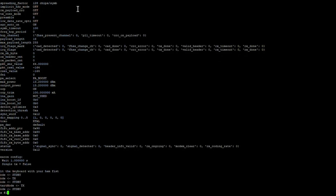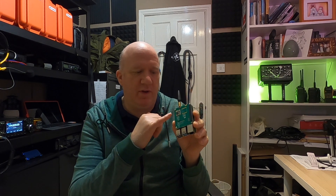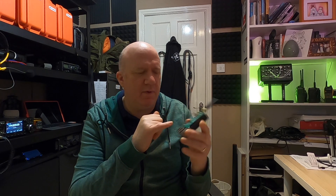I've had these devices now for just over a week. I did a quick update when I first got them — I've got two of them. I've now managed to get some code working on them. To find a library that actually works with the LoRa device, I used the chip number — the RF95, RF96, RF97 chip. There's also an SX1278, so there are two pretty dominant types of chips on these LoRa shields. I managed to get the equivalent of the hello world demo code working, so I had two devices talking peer-to-peer.